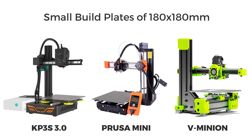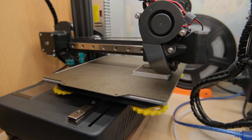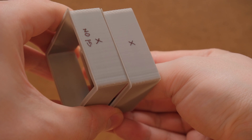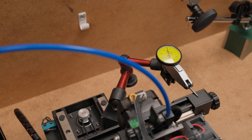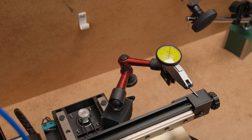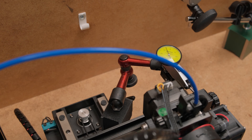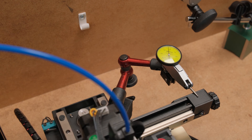This is especially true the longer the axis is, which is why you only see small printers with this cantilever style design. Because we have uneven wobble along the X-axis, even Klipper's amazing input shaping will be way less effective when pushing for higher speeds and accelerations. You might say this can't be true because the printhead moves along the X-axis and won't introduce wobble to another direction — and in general that is correct. But faster acceleration will make the axis wobble just a tiny bit up and down, making the nozzle closer or further from the previous layer, potentially resulting in artifacts. However, that is very minimal — we're talking about numbers around 10 times less than the regular layer height of 0.2 mm. So this is not the problem.